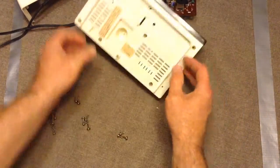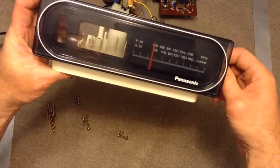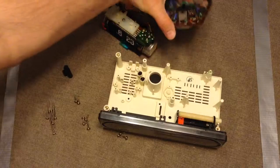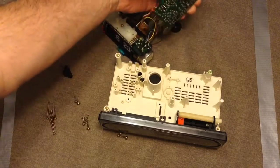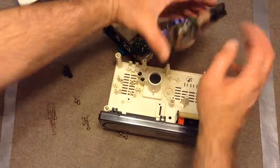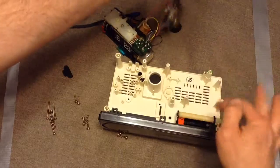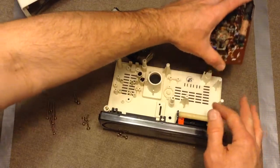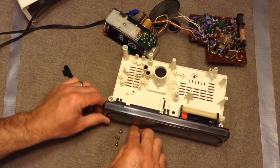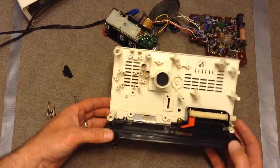Now at this point I can snap that back. Take it all the way over to the left, then take your selector and turn it counterclockwise — no matter which way it's oriented, turn it all the way counterclockwise until it stops. That's set up; you don't have to worry about it when you put it back together. Do that now, because otherwise you're going to have to take that clock apart again.